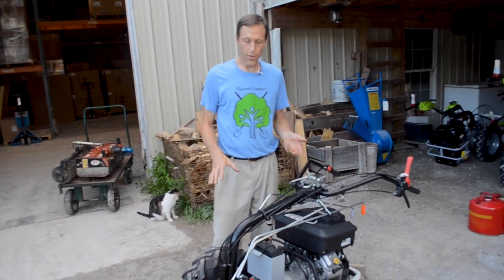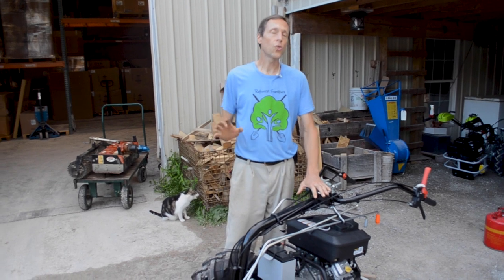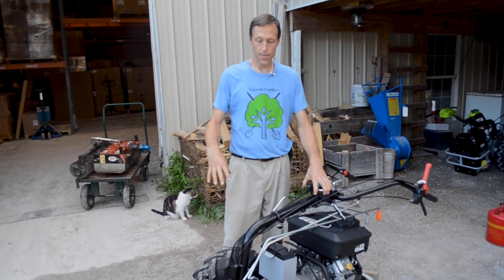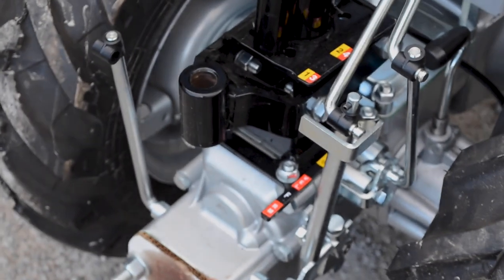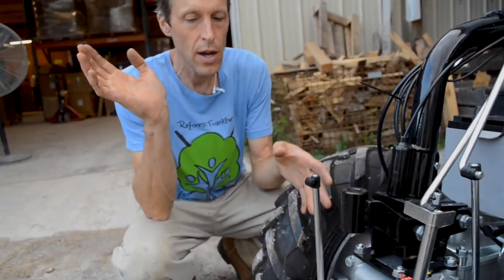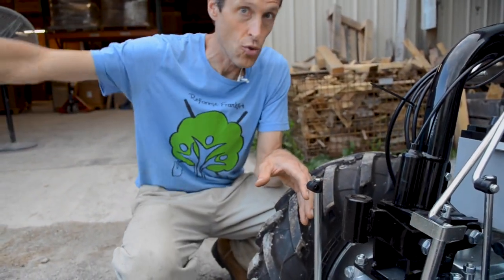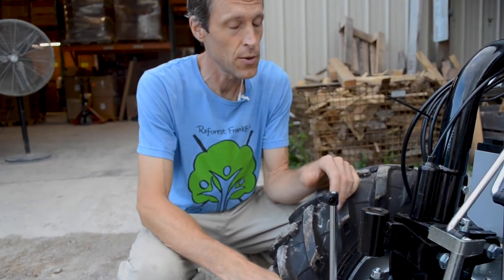Also, the G131 is one of two tractor models we carry that has a synchronized PTO unit available for it. That's a second PTO shaft that mounts right out of here. It's kind of a dealer installed option that allows you to have a ground synchronized PTO for running a driven wheel trailer. With the driven wheel trailer, you have PTO power driving the wheels of the trailer, so you essentially have a four-wheel drive utility vehicle. These things are very awesome.